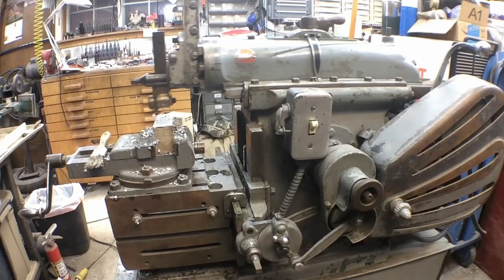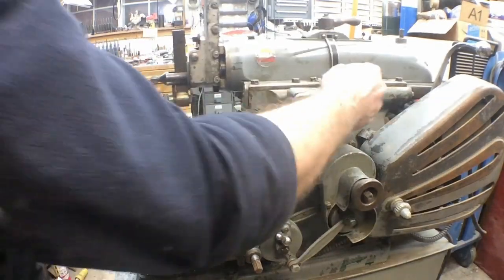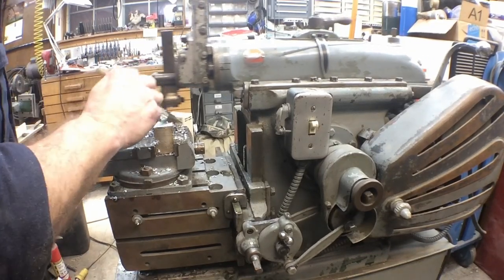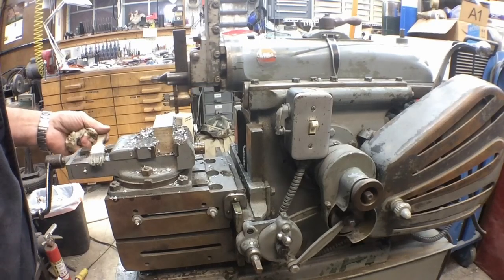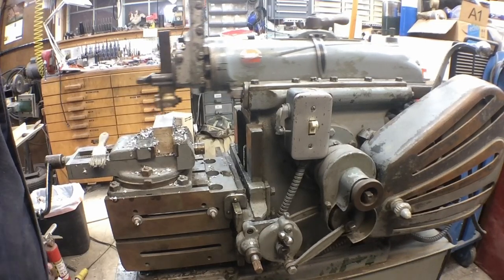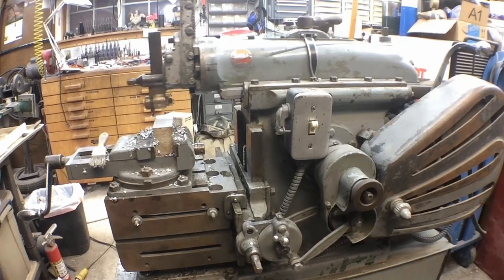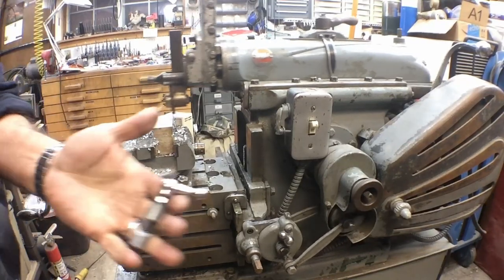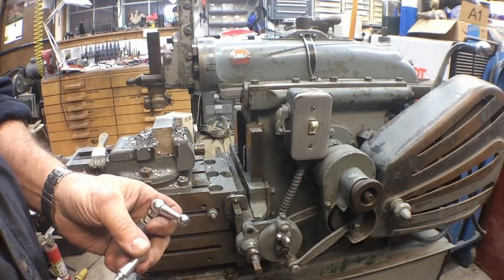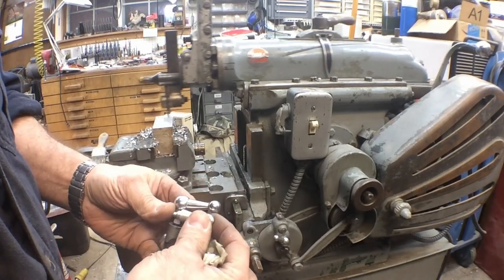This is just an enjoyable little machine to watch. I've spent about two hours here today just playing with it and it's been an enjoyable day. I'm going to finish decking off the top of this — looks like the last pass. Then I'll close up, go in, have a cup of coffee, and do some computer work. I've got some tuning to do on the CNC program for the handles for the milling machine. These are the original handles for the overarm — this handle goes down to the overarm support, and there are two of these on the head. I'll reproduce them in two parts of stainless steel.